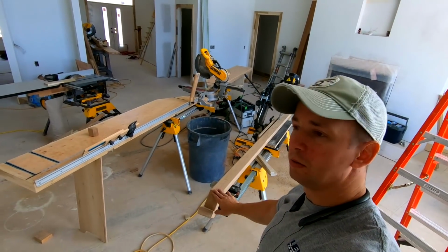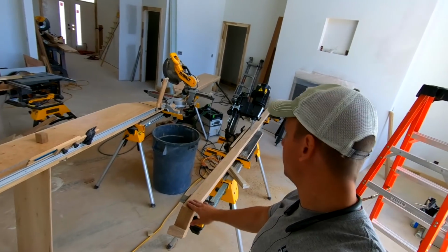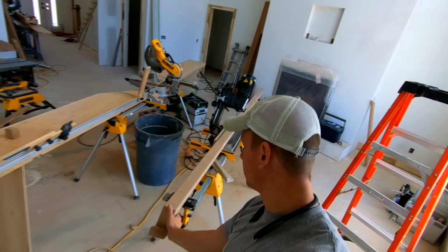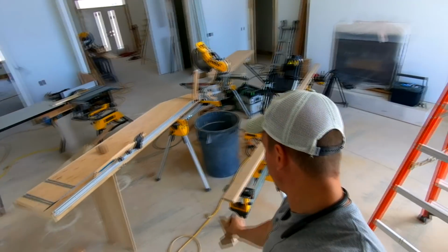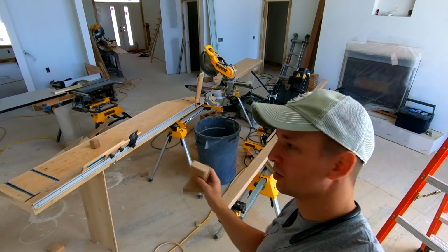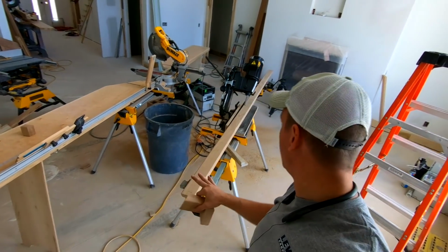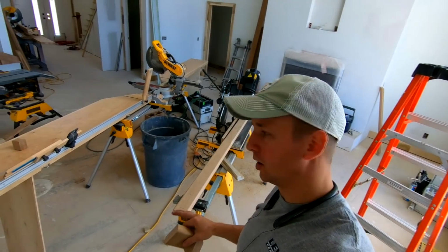Another thing, down here, my handrail drops. Those you cannot permanently mount before you mortise, because as you can see here, it's going to get in the way. So this was just put on with some pin nails, so I'll remove that and then I'll permanently attach the handrail drop after all my mortises are done.